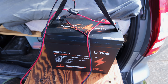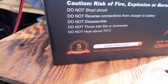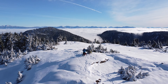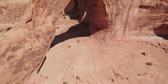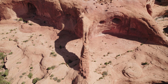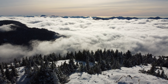If you're new to battery systems, one thing to look at is the charging temperature range. This battery charges between 0°C and 50°C — so for my American friends, that's 32°F to 122°F. The discharge temperature range is -20°C to 60°C, which is -4°F to 140°F. For storage, you can keep it between -10°C and 50°C, or 14°F to 122°F. Simply put: don't charge this below freezing, you can store it a bit below freezing, and you can discharge it down to -20°C.